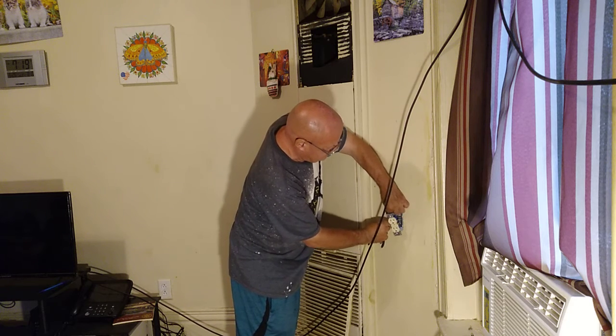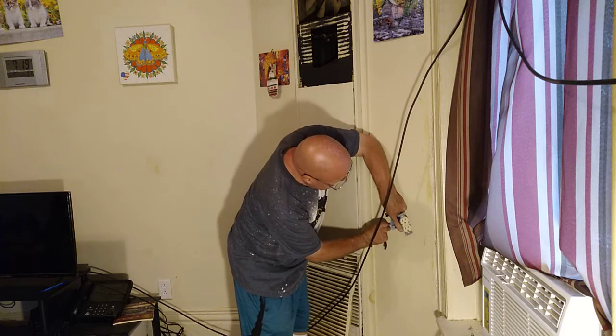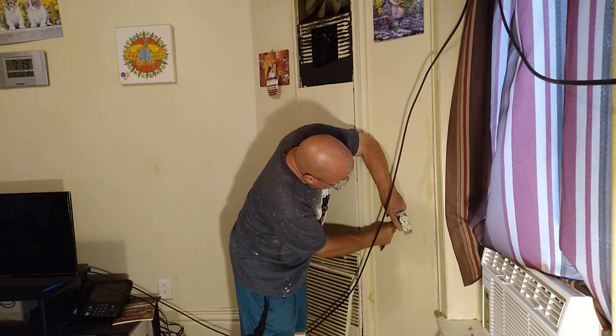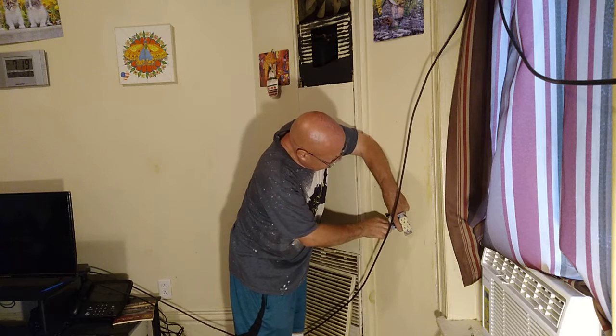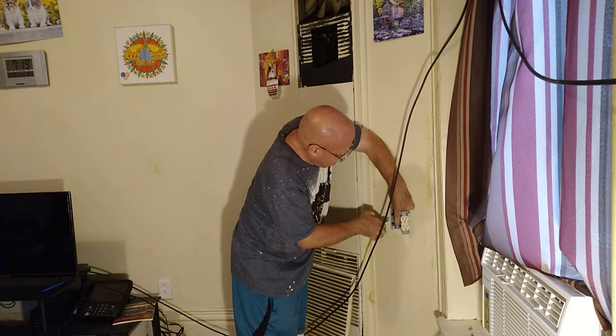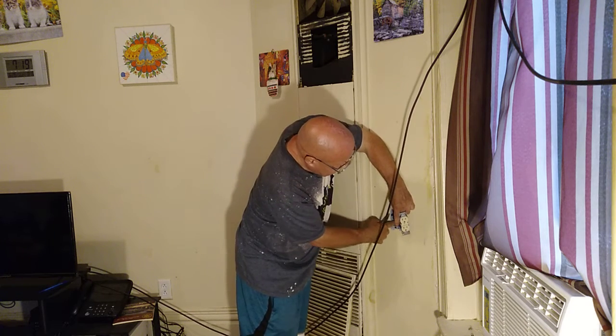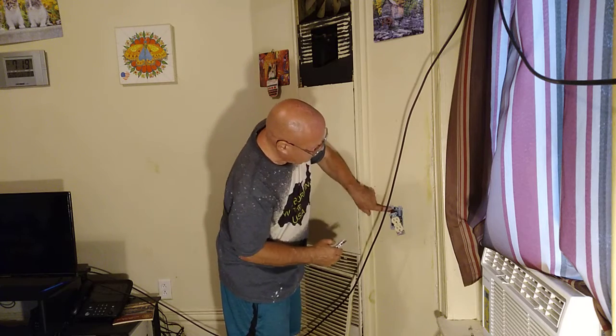Go in, down, push in on the box, bring that over. Take my pliers, squeeze it in, pull out, push it in. Take my pliers again, squeeze it in, and push this down so that the lower piece is down in the wall.